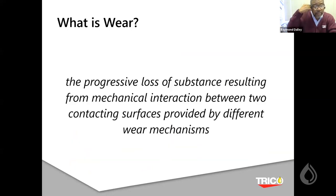So some people may say, if you haven't got involved with this technology in condition monitoring, what is wear? Typically it's the loss of debris coming from the mating portions of the machine components themselves. We have different classifications of the type of debris we see, and different wear mechanisms that create the wear debris. So what I've been trying to do is categorize these things not just into wear mechanisms, but also into particle classifications. And you'll see what I mean in the next few slides coming up.